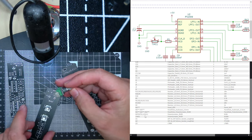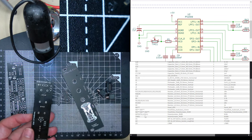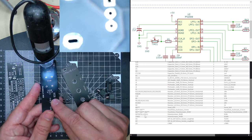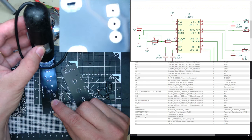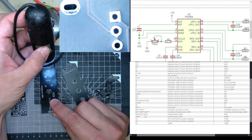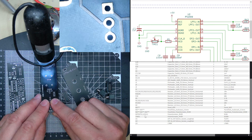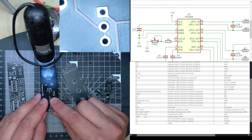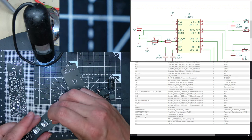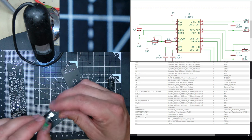And then to do the pot, do I have to know which end is which? Yeah, I can see here on the trace. Focus it. Only connected at one. See, two of the pads are connected. That means that's one end of the resistor and the other pad is the other. So what I need to do is, let me think, I need to draw this.